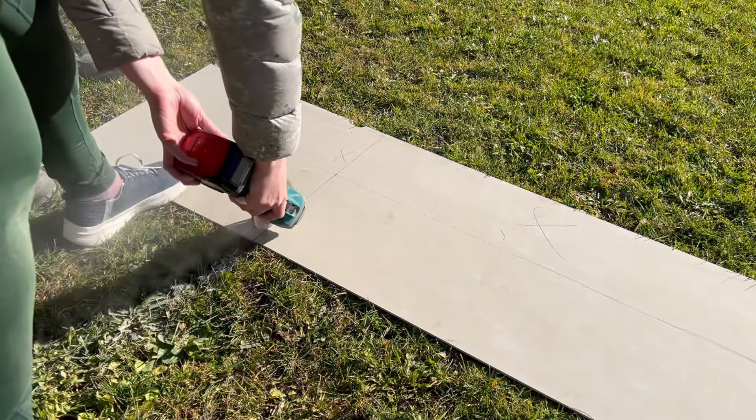While I was giving the grout on the floor a little bit of a chance to dry, I installed all new globes in the tastic light in the ceiling. Then after about 20 to 30 minutes I came back along with my water and sponge and cleaned off the excess on the tiles, making sure not to remove too much grout from each of those lines initially — just cleaning off the bulk and then going back along to wipe the excess grout on those lines. Once I finished the grout on the floors, all I had left to do was apply the silicone on the floor, and I was done.